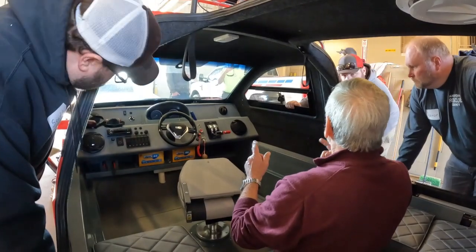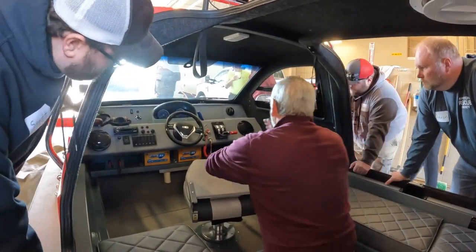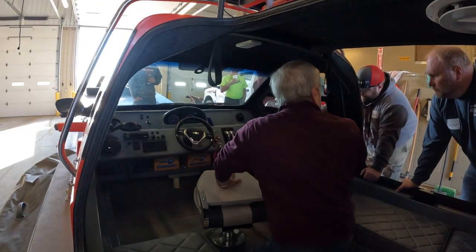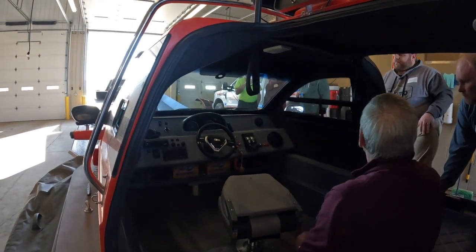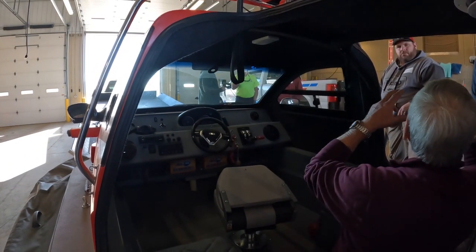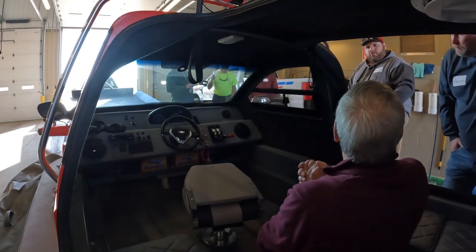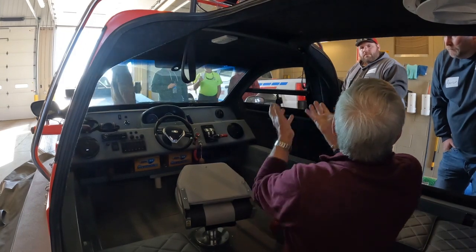And then what we do is we start the thrust engine first. So we've got that switched on just for the fuel, and we just leave it until the fuel comes through. And then we put this one on, and then we press the red button of that to start the thrust engine. Once that's running, that's creating the voltage supply to the batteries. And then you can start up the lift engine.